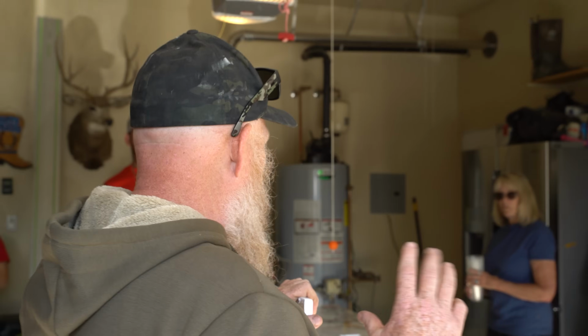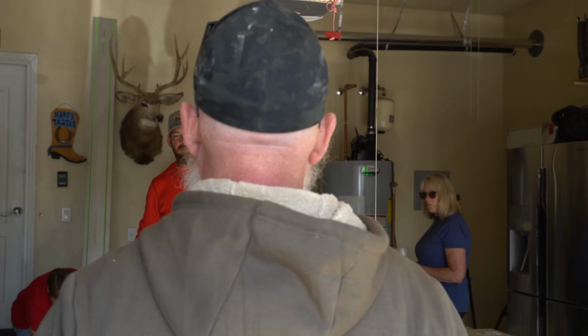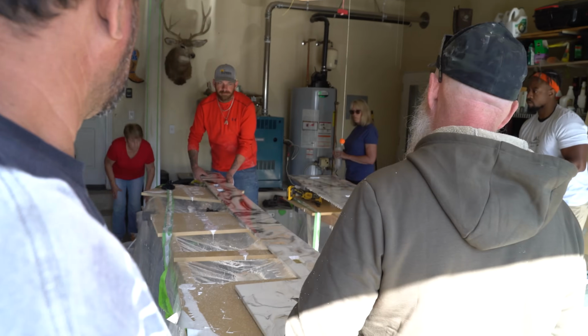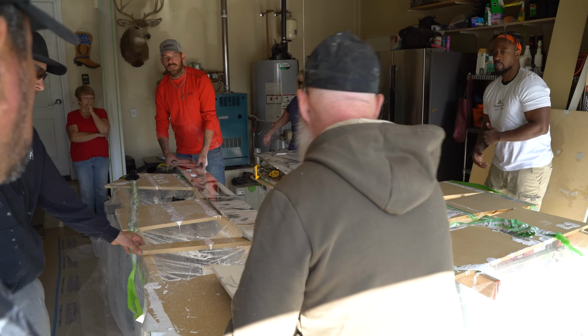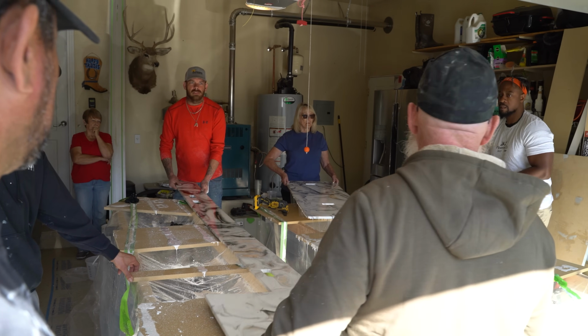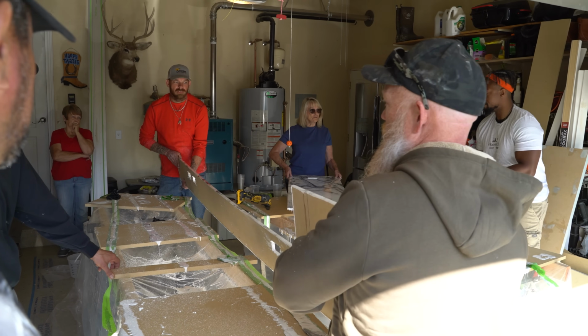But every time I've seen damage on a countertop, it's because it's setting flat like this. They pick it up and then they move it. So you always tell people, slide it to the edge, and I always only slide. Once it's off that edge, I can pivot it and I'm using the countertop to support it. Everybody always goes to the edge, and then they pick it up and do that. Think with your head and roll it.